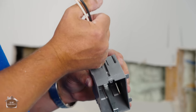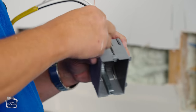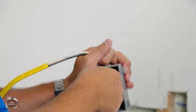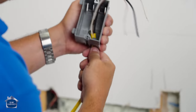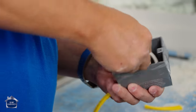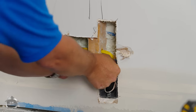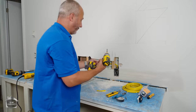These boxes have a foam on the back — more like soundproofing. You push them in, bend and then straighten out, then they start to curl and you can pull it through the box. You just feed it in until your cabling sheathing is about a half inch on the inside. Take this ground wire around that screw and then tighten it in. Take your wires and curl them all up into the box. Now we're going to fish this through the hole and get this where we want it. I'm going to leave this just a little bit proud because I'm going to be adding backsplash tile. We're going to take a couple of flooring screws and screw that box right to the stud on the inside.